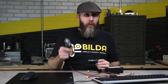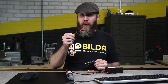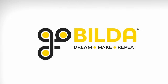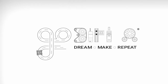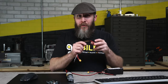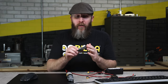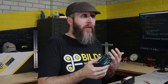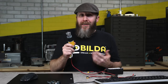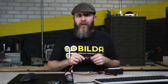How do you use an Arduino to control a big, beefy brushed DC motor? The answer is an external motor controller, and in this video we're going to walk you through exactly how to make that work. Arduinos are awesome at a lot of things, but one of the things they can't do out of the box is output a lot of current — only about 40 milliamps per pin — and a motor like this is going to draw a lot more than that. So we're going to use this 1x15 amp motor controller from Gobilda to control the motor.